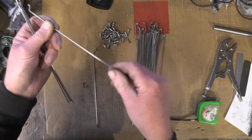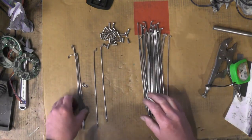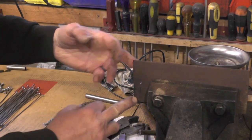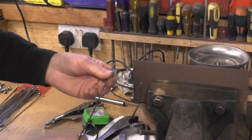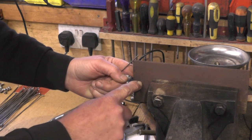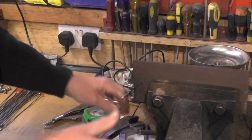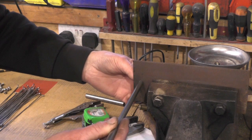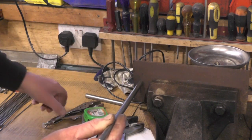That way it's leaving all my thread intact. I'll show you how to do one and then it's just repetitive work. I've got a piece of one-eighth plate — 3.2 millimetre — with a hole drilled in it to suit the spokes, in my case 2.5 millimetre. On each side of the hole I've chamfered it with a centre drill just to take the corner off both sides. Then I thread my spoke in, and I've made a little jig to get every spoke to the same length.